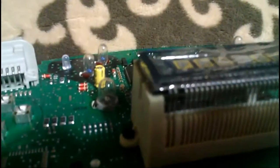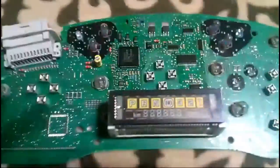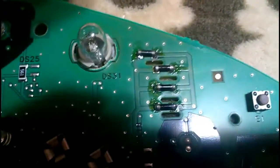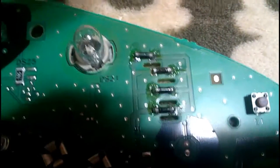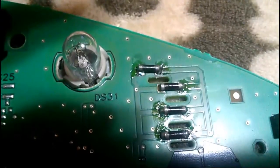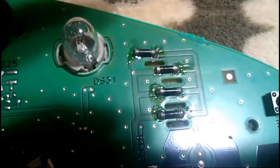It all looks good otherwise. The only other thing I noticed is right around this area, one of the tabs going in looked a little bit charred. My camera's not going to focus on that too well, but it also was not part of the problem — just so you're aware. An inspection of all the resistors on here revealed these four right here. What I first noticed was the top one — the electrodes on the end looked pretty dark in color. So I touched it with my finger and put a little pressure on it, and it just rolled right off. It broke loose from the circuit board.